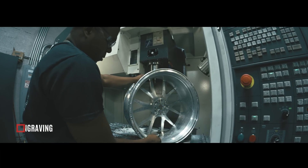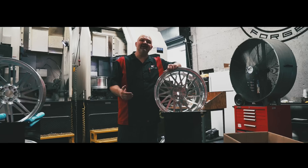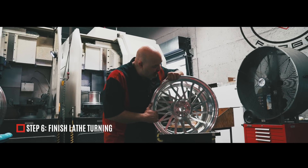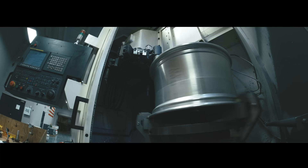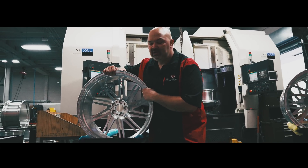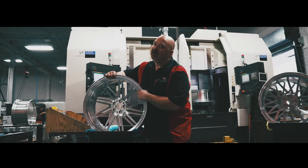The next step is the finish turn. The last step in the machining process is a final inner and outer lathe turning. This is what we get out of the mill. We center the wheel within 1/1000th of an inch in our finished lathe. After that, you get the finished product, which is within 1/10,000th of an inch in our runout.